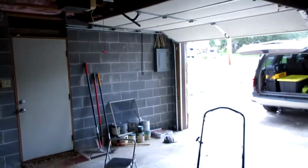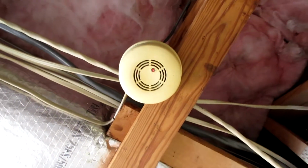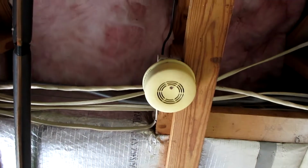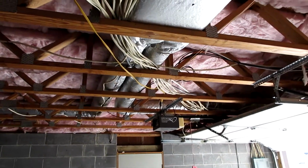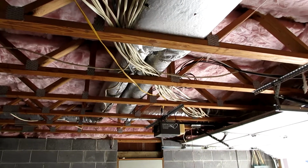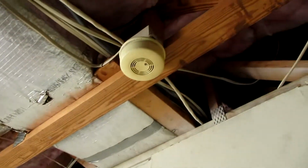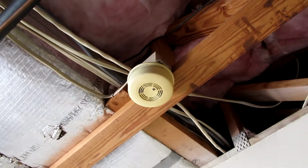So I'm going to go over at the box and start turning breakers off until I can get that red light to go away, and see if I can get into that box and run some power. I may be able to use that same junction box. I've got another one just in case, but I'll use that same box, tie under some power there, and run an outlet over there and make everybody happy, because the tenants are moving in tomorrow. So we'll do that, and I'll find out which breaker this is on, turn it off, and then I'll film the rest of it. Until then.